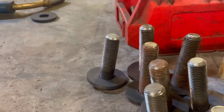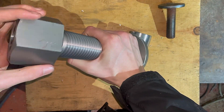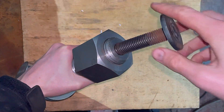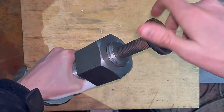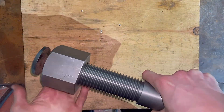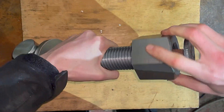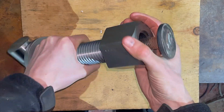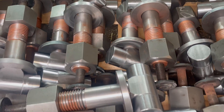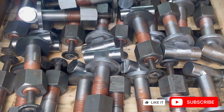That's all the parts needed to assemble these bolts. So you have your bolt, then your washer, then the nut goes on, and then the mushroom goes on at the end. We use these mushrooms to catch the nut if they ever come loose, as these bolts are used to keep a lid on a massive high-pressure drum that's 34 feet in the air. You can imagine one of those nuts hitting you on the head from that height could really do some damage. Thank you for watching - if you'd like to see more videos like this then hit the subscribe button.